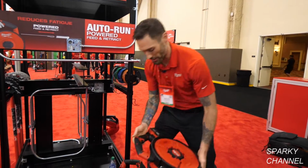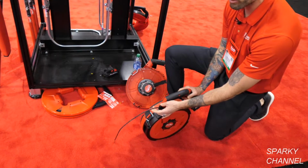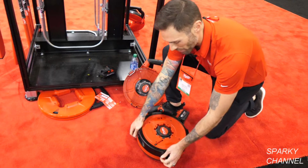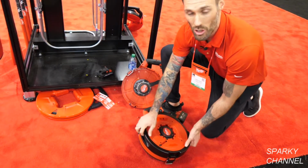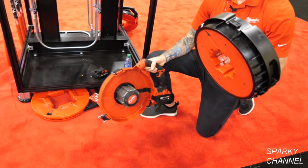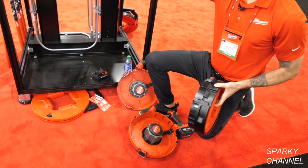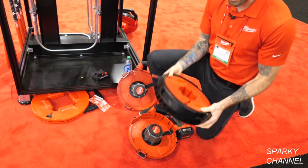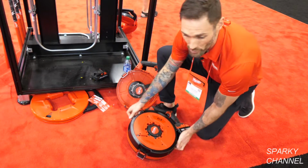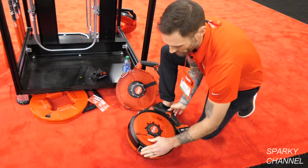It is a variable speed trigger, allowing you to have control of how you would like to feed or retract that in. Our 4 drums that are compatible with this have a 3-latch quick change, so you can have your power base and your individual drums that go along with it. So if you're feeding into a live panel or a box, you can use a non-conductive. If you're feeding those longer runs that aren't live, you can use those 240 or 120 steel tapes.